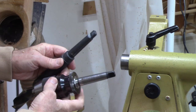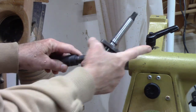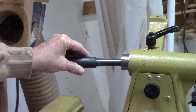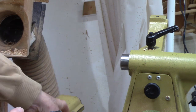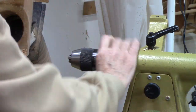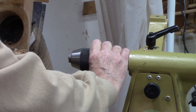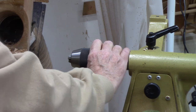Neither my drill nor my large Jacob's chuck have a draw bar for the tailstock. You've got to be very careful when you're retracting from drilling, especially when turning green wood, that you don't have it embedded and it pulls itself loose. I always recommend keeping your hand on the drill chuck as you're extracting it, so if it starts slipping at all, you can reach over with your left hand and turn the lathe off.